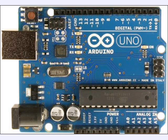All right, this is a more modern board called the Uno. It's really the same as the other, with a notable difference. Over here we have a USB connector. This will connect directly to your computer's USB port. It has a chip built into the board, an integrated circuit that will convert USB to TTL levels.